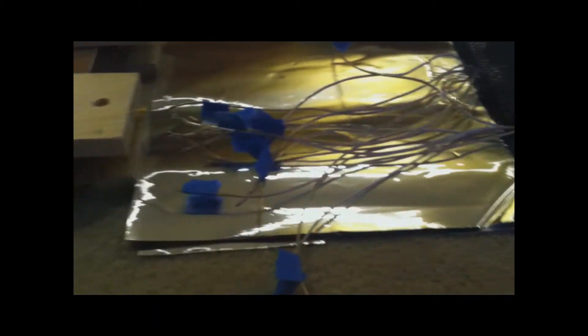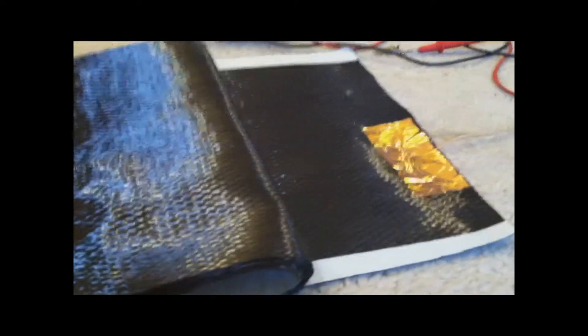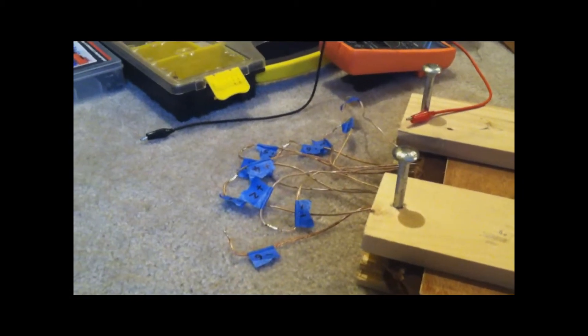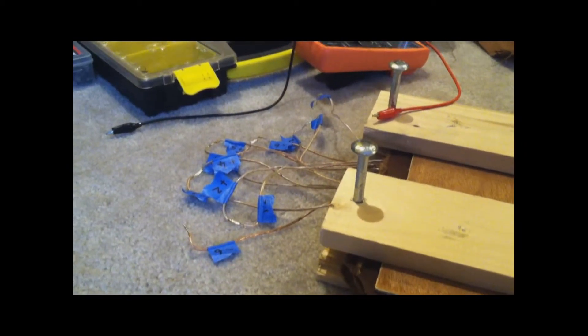So I decided to go with it in series. Now, over here I've got another six plates of aluminum and six sheets of carbon fiber. I'm going to stack them on top of what I've got here and hook those up in series as well, but then wire the two together in parallel — that way I should keep the same voltage and double my amperage.